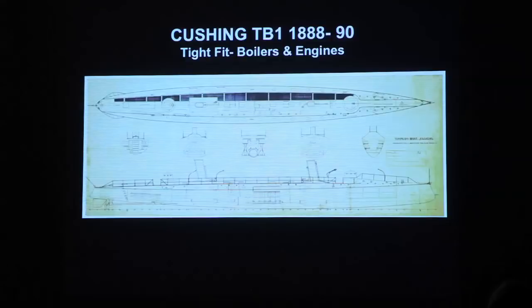The coil boiler and the square boilers were very difficult to control at height — the larger they got, the more difficult to control. It was difficult to prevent excessive superheat or excessive temperature, which would burn the machinery, or moisture carryover. It was probably one of those conditions that convinced Herreshoff to go to the Thornycroft design. Having gone to the Thornycroft design, he then applied that to his private vessels also, and Vamoose actually had a Thornycroft boiler exactly like the one put in Cushing.